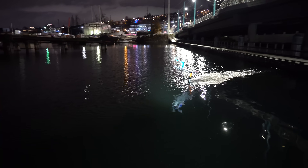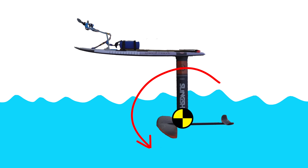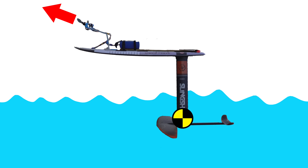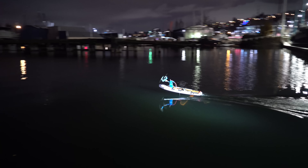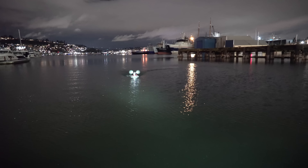One thing you might notice is that the motors are angled upwards a bit. Since the hydrofoil is underwater but the board is above water, its center of drag is going to be way down there. So if we add thrust from the motors pulling forward way up here, it's going to cause the whole board to pitch down and just nose dive. But by angling the motors up, they're helping to lift the nose up, and that gets rid of our downward pitching force. Having the motors tilted up is really the only reason I'm able to get away with having them mounted so high above the foil.